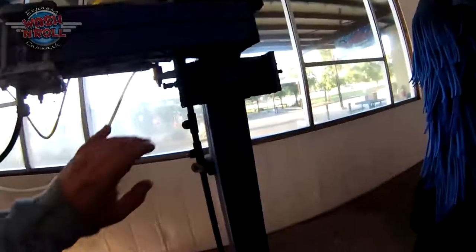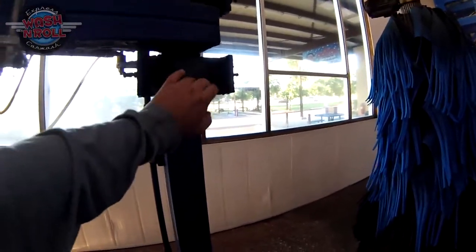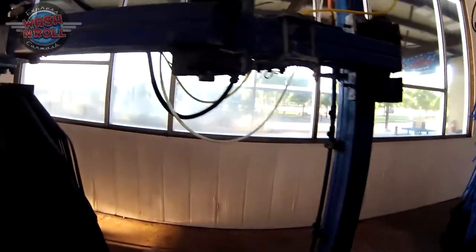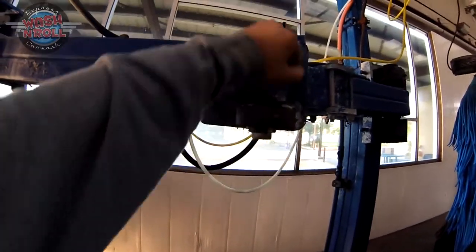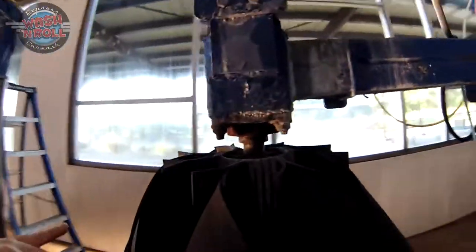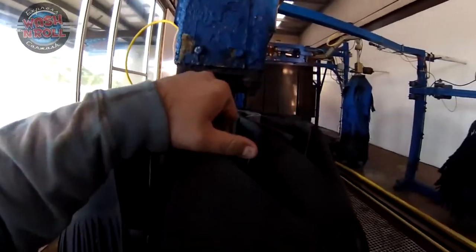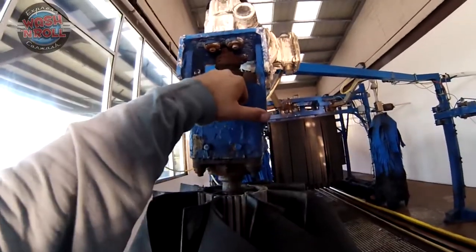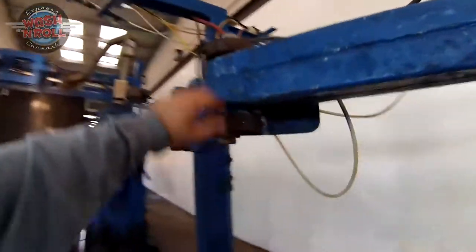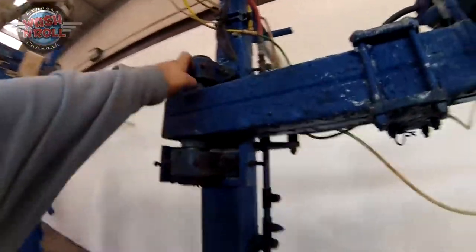Our grill brushes are going to have a total of six grease spots. You've got two here and four there — those are grease zerts but two bearings, greased on either side. There are two more spots right here to grease, two bearings, and then two more bearings with two more spots — one right here and one right there. The same applies to the other brush: two here, two here, and four here.